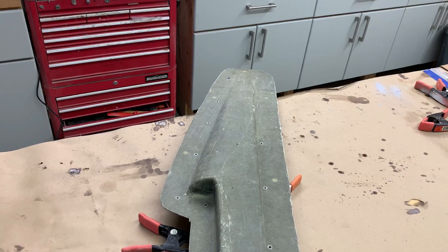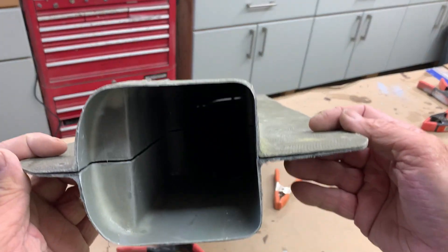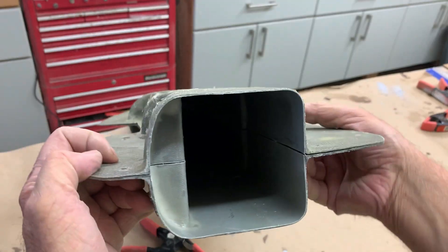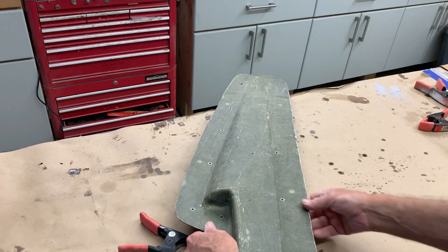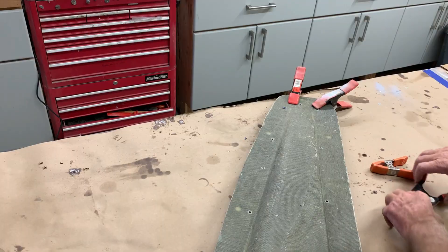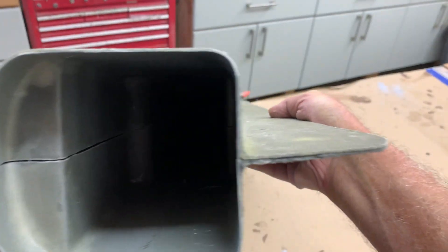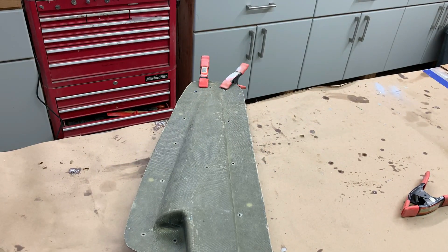I'm going to show you a trick here. I want to make sure my seams are nice and close. You can see that little air gap down there, and there's one up the side here a little bit. So what I'm going to do, just to make sure everything is rosy, I'm going to put a couple of clamps on to simulate my screws. And see what happens — she's all closed up. No light coming through the seams, so that means it's good. So now I can screw this together — I've trimmed it well.